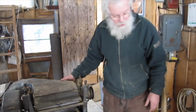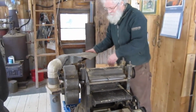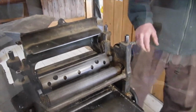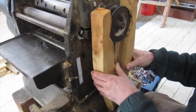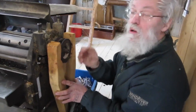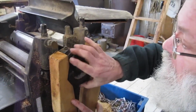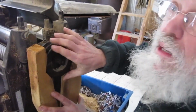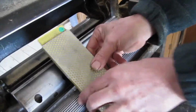And taking a couple of screws out of my dust extractor, and so now I can open up and expose the blades to the machine. There's a low notch in the lower end of it which goes around this shaft, and the top clamps on here, and these surfaces come out parallel, so I can put a woodworking clamp on there. That way I can lock the cutter head absolutely, and just by putting a clamp on here, now the cutter head cannot move. I wrap tape around one end of the diamond stone and lay it on here.